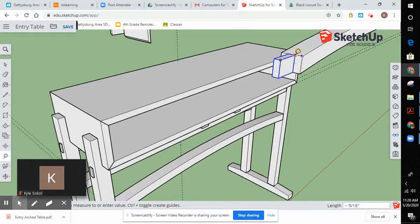So if I was to bring 9/16, all I'm going to do is use your layout line or your ruler. Mark those two areas. So you'd have a layout line here, and then on your opposite side, go to your pen tool, click your 4 points, use your push-pull tool to pull that out the length of what that tenon is, 1 7/8, and go ahead and place that in there. What I would do then when I move them is I select the tenon and that rail. Drag that into place, and you made your arched rails.